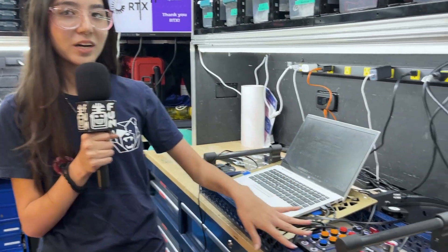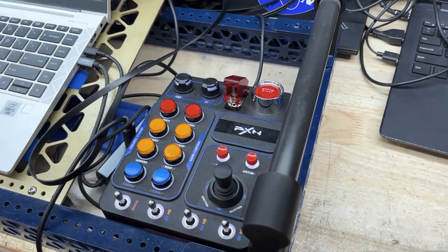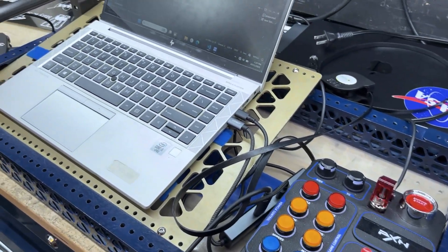In the beginning of the season, we utilized this button box right here which corresponded to a pole on the reef. Changing to one driver also allowed us to have two human players — one at each station — which allowed our driver to go either way, since early in the season there was a lot more defense. Moving to our Limelight setup: our robot is very pose-heavy. We utilize two Limelight 4s centered right in front of the tag so we can see a tag at all times when lining up to score. We use MegaTag 1 and MegaTag 2 to get the best pose possible, as our robot utilizes pose not only for snap auto drive but many other things. Having really good pose is needed for consistent scoring. Having all of this makes us a better team and allows us to do more in algae, coral, or hanging — everything becomes more cohesive with a good pose, which is why our Limelights are very important.